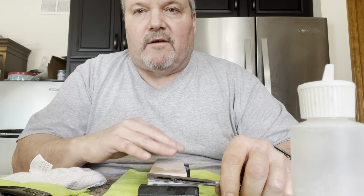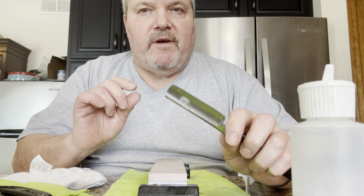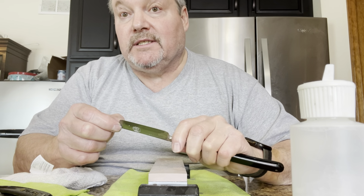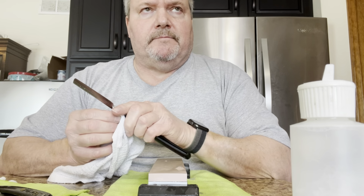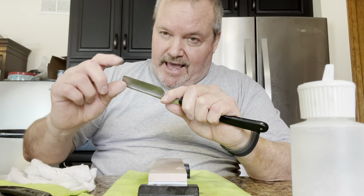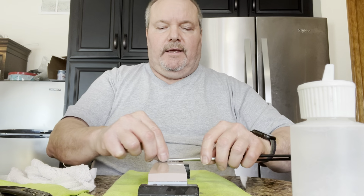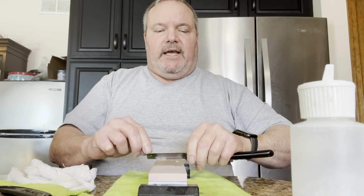So at this step where you're back on the long radius with a fine grit stone, you're only contacting out on a very, very small portion at the very, very edge of the razor. I've looked at this and I've seen it on more than one razor. I don't know about some of the real thinner grinds yet, because I've got to work with that a little bit more, but I didn't start looking for it until recently when I saw it on one of these gold dollars. But you could actually see where you're working at a distance out here where it's like half of the bevel you can see. So it does not take a whole lot at this point to refine that edge.